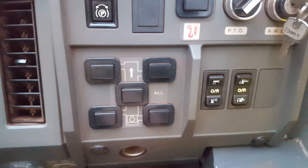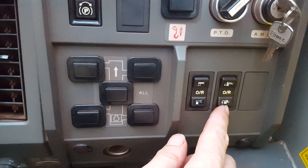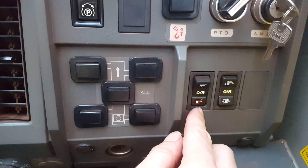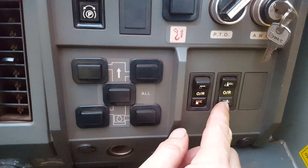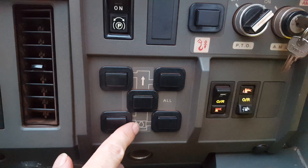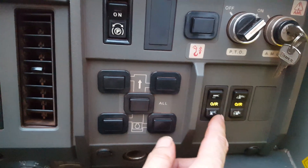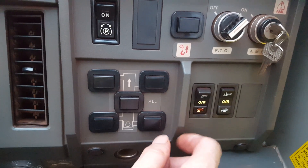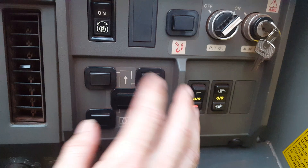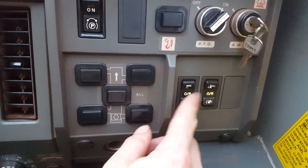Now you've got the outriggers. You've got the rams there because it's highlighted bold, then you've got the sliders. You've got up and in, and down and out. All you do is select outriggers down — that highlights — and then you either go retract if you're set up, or extend if you want to set up. Push whatever outrigger you want, or push all of them at once. Now if you leave these on and you don't put them back in neutral, an alarm comes on. Because if you touch one of these while you're set up, you might have an accident. Always put those back into neutral.